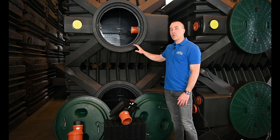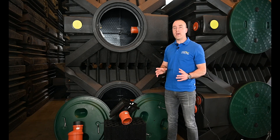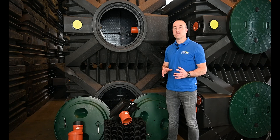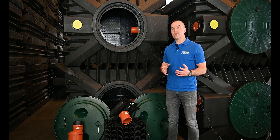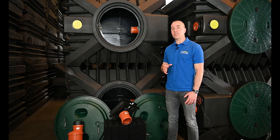If you look at the tanks that we use, we use rotationally moulded tanks. These are single piece tanks with no welds and no seams. They have many advantages to other tanks on the market. If you compare them to polypropylene tanks, they're much better. Polypropylene tanks have welds and joints that can break and leak over time. Then if you look at another popular material like GRP or fiberglass — many tanks are made of these types of composite materials — fiberglass has an extremely low impact resistance, so you need to be very careful when you're installing the tanks. So HDPE rotationally moulded tanks, which are what we use, are the best on the market.